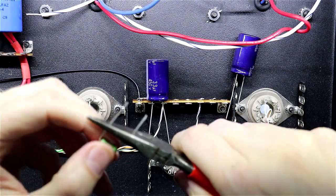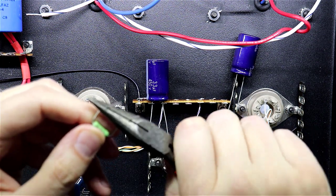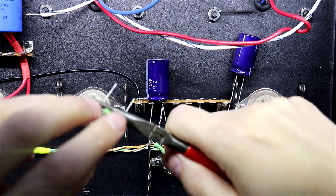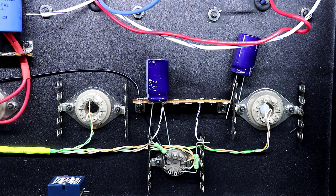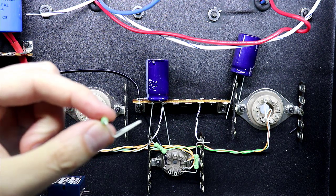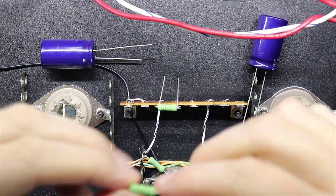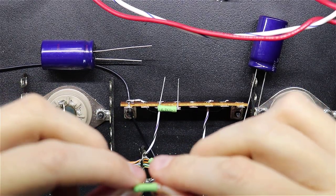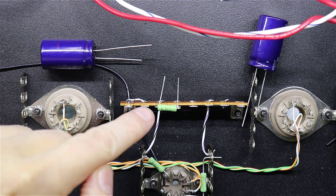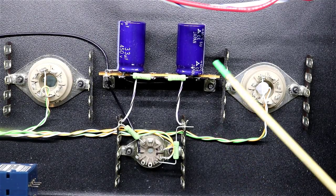I don't always double my order, but just a thought. The other thing, I use a lot of straight angle edges of pliers and whatnot to bend leads with, so that when you get done, you end up with nice sharp 90-degree bends on them. Just makes things look good. Not sure if you can see this or not, but I've done it here and I'm doing it here as well. It just takes a little more time there again. But I always bend my leads so that I can read component values when at all possible, once they're mounted into the amp.